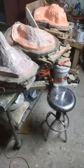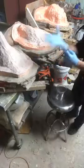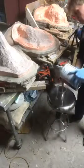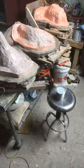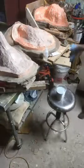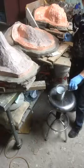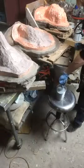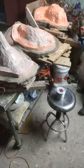Gloves. Need gloves. Going to go through a lot of gloves, because once you get them gooed up and hard, you're kind of done with that glove for mixing. Got a couple brushes there for us? You got one? Get another one. Alright, I'm going to mix this one to about 30. I had a little more pre-made this time. And then MEKP and the Bondo activator. Let me move a couple tools, I don't want them damaged by this. Move my clay block, I don't need to contaminate it. Okay, so I'm about 15 this time. Here's my MEKP. Here's my Bondo hardener. Looks like a small black garden snake.